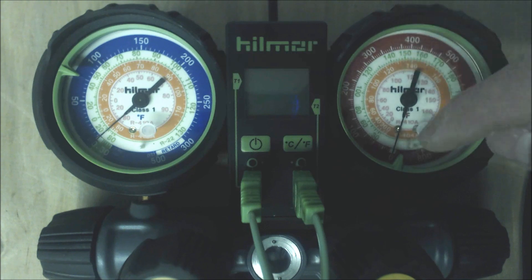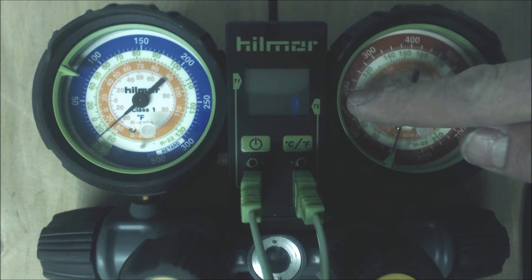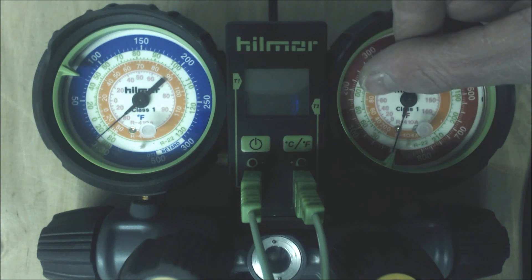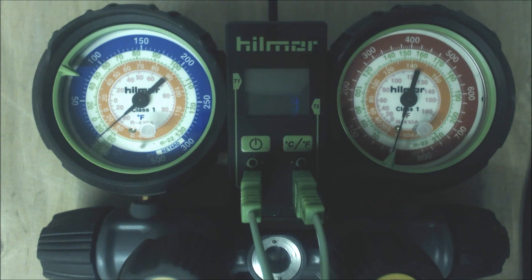This gauge does not know what it's hooked up to. Whatever pressure reading you have — hooking up at the liquid line right at the service valve of the outdoor unit — you follow the needle into the saturated temperature of that particular refrigerant. That tells you what the temperature of the refrigerant is in the middle of the outdoor coil. Let's give ourselves a scenario: say we had 175 PSIG. You follow that into the green saturated temperature, and it looks to be about 91 degrees.